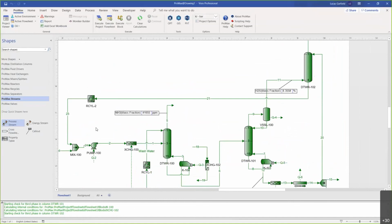And now we've really got 4 variables that we have to think about tuning, and they all affect each other. It's a very, very nonlinear system that's very difficult to control and to understand. And so really what you need to do here is either use the scenario tool to help generate maps of the surfaces so that you can understand how the system behaves, or another option would be to use some kind of nonlinear optimization protocol.